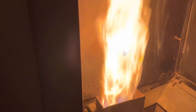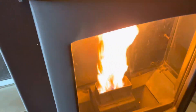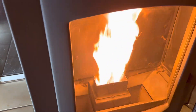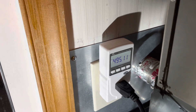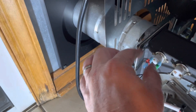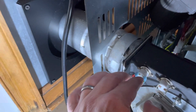I can feel the heat getting pretty warm on the side — don't want to touch that. All the creaks are just thermal expansion, that's normal. It's definitely performing better; it ignited quicker and cleared the smoke out quicker — it's breathing easier. The watts are still at 495 to 500, so the igniter is still on. There's a thermostat in the back — looks like two are mounted in case one fails — and it's measuring the temperature of the exhaust gases.